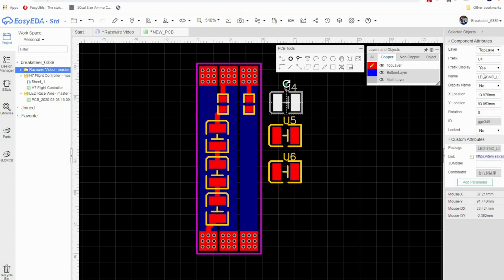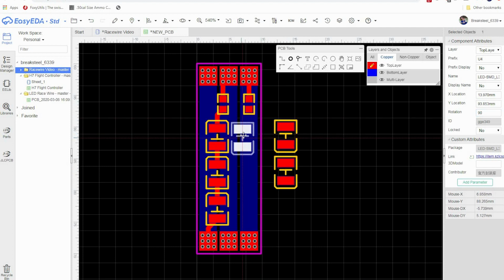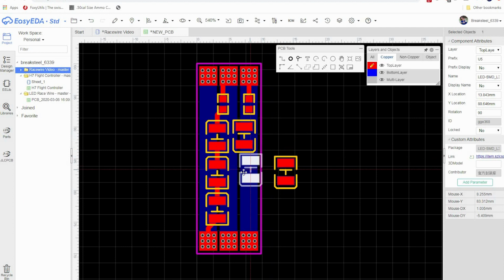We're going to select this. We're going to turn this off. We said 270, so we're going to go with, I believe, this 90 is going to work here. Okay, same thing with this one. We're going to turn off the prefix, and we want to go with a rotation of 90. Same thing here. We want to go with no, and we want a prefix of a rotation of 90. So if you notice what we're doing here, and this really doesn't matter because it's just going to put pads, but this is just showing you so you can see visually what direction you're having something go.